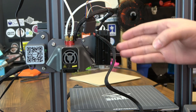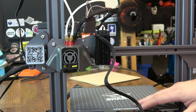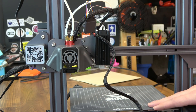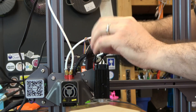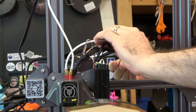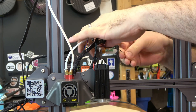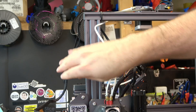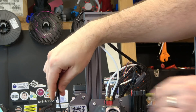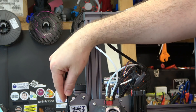The downside is when you have it on a sidecar like this, you're going to lose some build area. When using the laser, you only get 175mm in the X, but you do get the full 235mm in the Y. I'm going to run my laser wires up over the top, also securing my touch sensor with a zip tie. We'll make sure we have some slack, bring it down the side, and follow the same path as the touch sensor and the second dual color hotend and extruder.